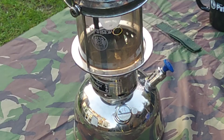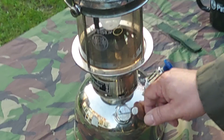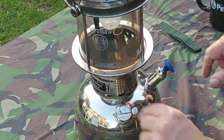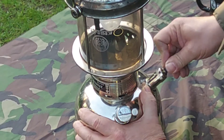With the new one we'll set it up from scratch, but I'll show you this anyway. So here you've got the gauge — make sure that the paraffin is in the tank, make sure the little valve is closed, and then pump this up until you get to two bar.